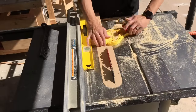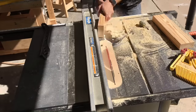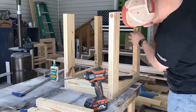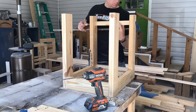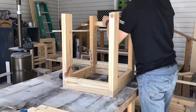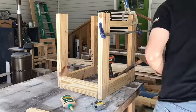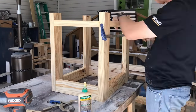Now it's time to cut our two-by-twos for the stringers on the bottom. I'm using my Mast-R-Lift feather board to keep everything pressed against the fence, and then a straight edge to joint one edge. To install those two-by-two stringers, I measure down from the bottom of the leg two inches — that's from the bottom of the leg to the bottom of the stringer — and then I just use clamps and pocket screws.